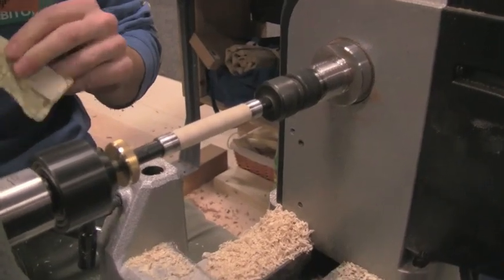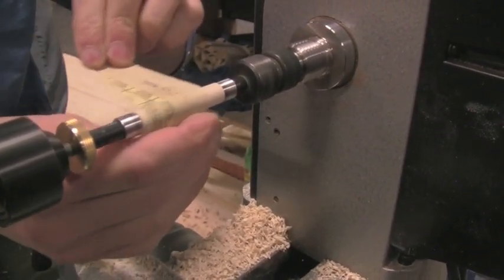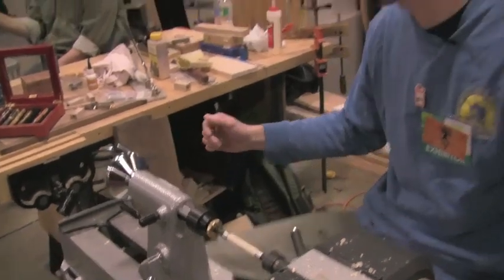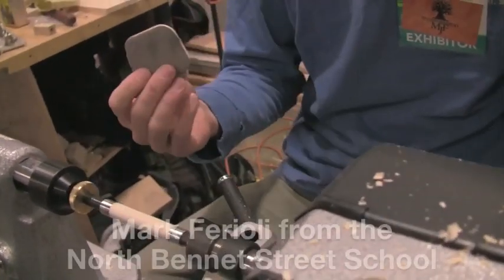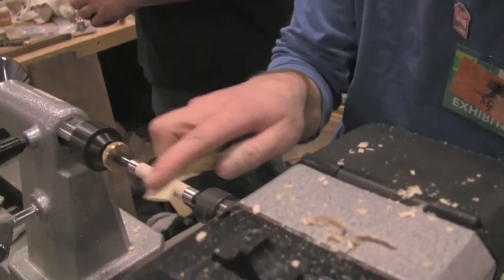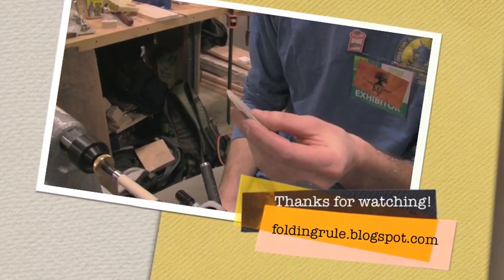Here's the easy and almost fun part of turning — it's low risk. Sandpaper can still go further than the bushing if you're not careful, but it takes off much less than a turning tool. I would probably start with 180 grit, then work your way up through sanding pads and micro mesh pads that go up into the thousands. My last one would be around 12,000 grit — that's what gives your pen a polish. It actually almost polishes itself without any finish. After 220-grit sandpaper you can jump to the pads, which start at about 600 and go all the way up to 12,000 grit.